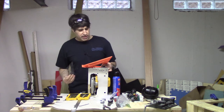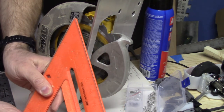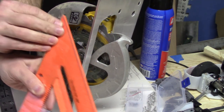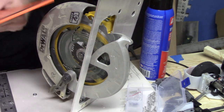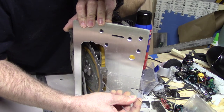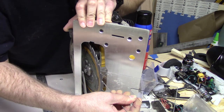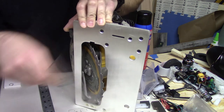What is reliably 45 degrees are drafter's squares, because for drafting purposes these need to be exactly 45 degrees — that's the right tool to use for calibrating your circular saw. In fact, I've put the drafter's square over the speed square and you can tell the speed square is off by maybe a degree or two. That's enough to cause issues if you're going for a super precise cut. With the drafter's square, the saw fits in there quite snugly — pretty close to a true 45 right out of the box.